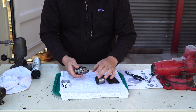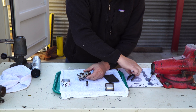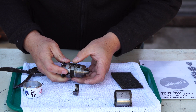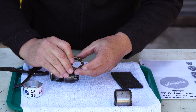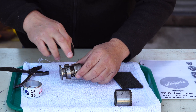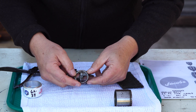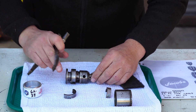This one's super sticky. Look at that big piece of leathery grease — it's not even hardly lubricating. Now this nut is pretty special. It's one of the few things you're going to buy that's broken, and it's broken intentionally. It's called a cracked nut, broken nut — heard it called lots of things. The only way to get it back on that arbor is if it comes apart. They didn't want to have a fastener, so they broke it. There are some intentional little saw marks where they weakened it so it would break where they wanted. Super clever design — Arthur Jacobs is the man.